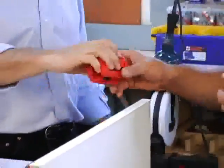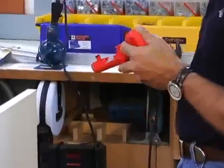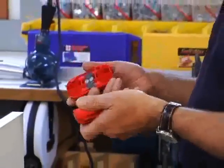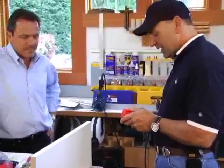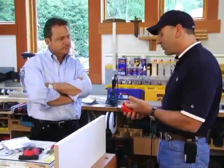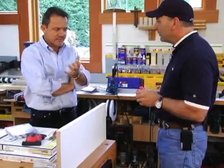But the other thing that's cool about the quad trimmer is that it trims both directions where the old ones do not. It trims both forward and back. So you get twice as much trimming because it trims top and bottom, back and forward. The one I'm using here is the carbide one. The red one's carbide, the blue one is high-speed steel. This is about $39 as opposed to $20. And the difference is longevity on the blade.